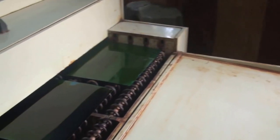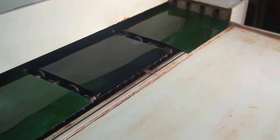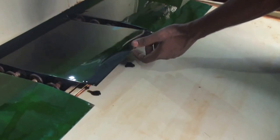Since this is just a demo center, once we have these sheets out we have to put them back inside from the front. In one pass we will only be able to etch partially. In order to cut this sheet, which is almost 0.15mm thick, we need almost 15 to 20 minutes. This totally depends on a lot of factors: the quality of stainless steel, the grade of steel, the thickness of the sheet, and the quality of the chemical. There is also a safety extension tray — you will see some chemical coming along with the sheet, which will go back to the machine.